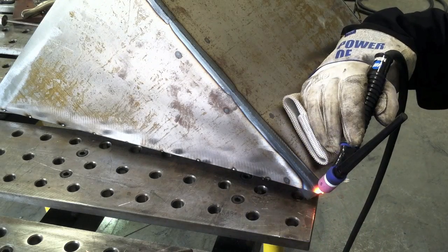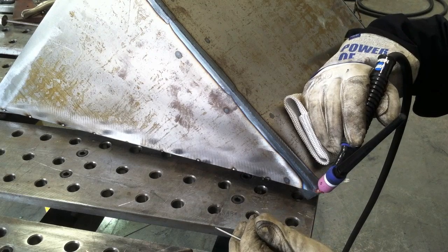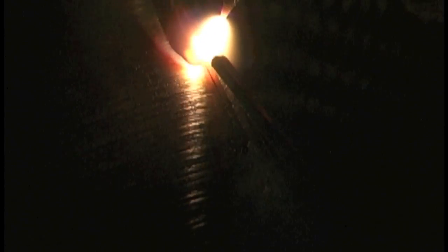That's the benefit of having a foot pedal — and also the benefit of a foot pedal over a torch-mounted remote is that you don't wiggle the torch; you want to keep it in there tight. I went a long distance because I had the TIG finger on, being able to slide a good eight or nine inches. Now the heat's about right here — I'm just able to zip along at a real good travel speed and the puddle's not getting squirrely. Not a real tight arc because I'm shaking a little bit and I don't want to clean my electrodes all day, but that's what it looks like when you've got the heat pretty close.